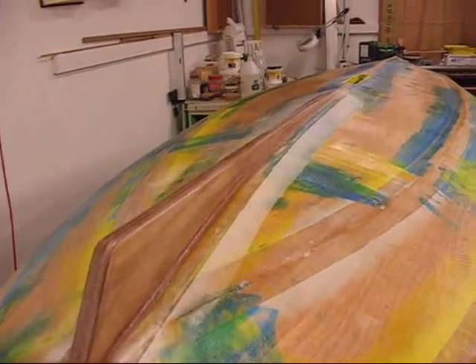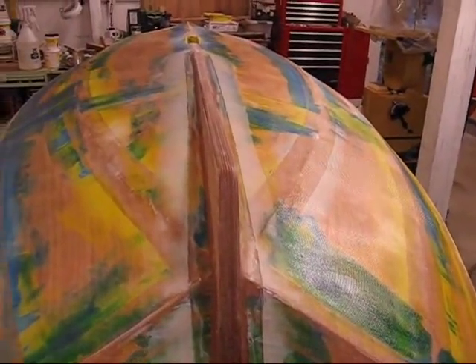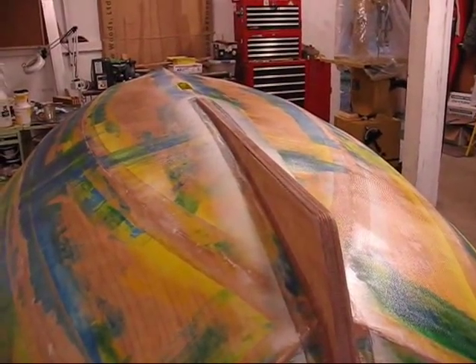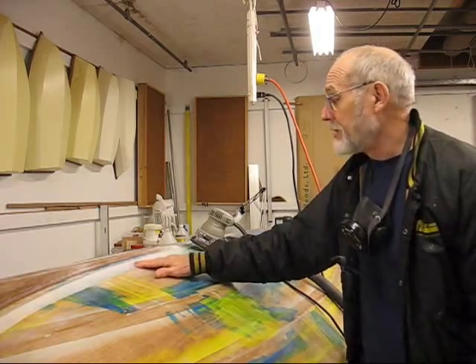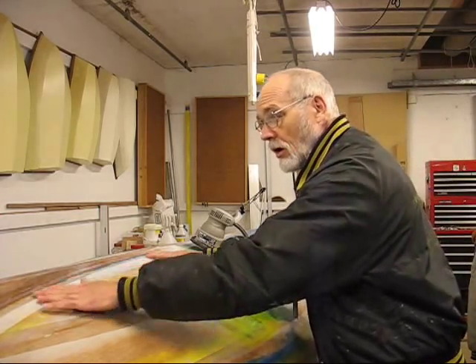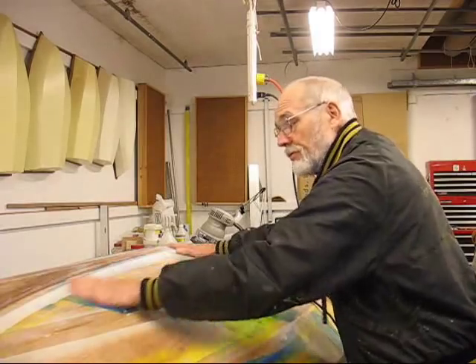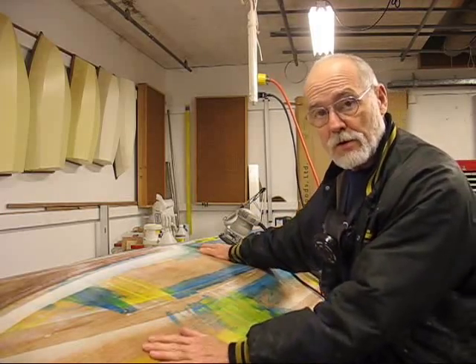I've got it faired in just now, so I can go ahead and sand it tomorrow and we'll start on the weave fill. I've just finished sanding out the hull where I had put in the fairing compound yesterday around the edge. We cut off the tape and the glass for over the keel strip here, so this is all faired in now. I've gone over the whole hull with a couple pieces of sandpaper to smooth it down. Because it's been over 72 hours since we last wetted out the glass, I forgot to mention that you have to wipe it down too — so I'm going to wipe the hull down now a couple of times and get all the dust off.